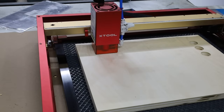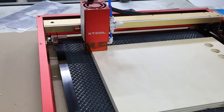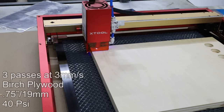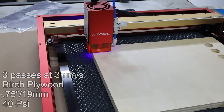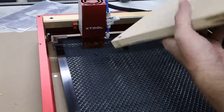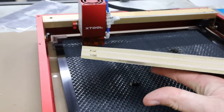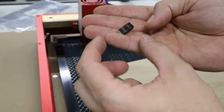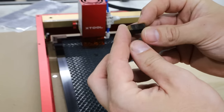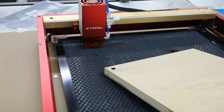Here is some three-quarter inch birch — figured we'd try to make something using the metal we can cut and use this as a backer for it. Three passes at 3 millimeters a second, we need 40 PSI. I think we just cut through on the second pass. It just fell out — this is insane. The thing is cutting better than my CO2 laser does. Look at the edge quality on this thing — there's not even any residue. All right, we have some serious power and capabilities. Let's make something cool.